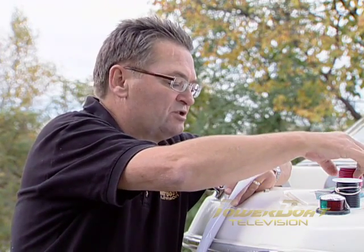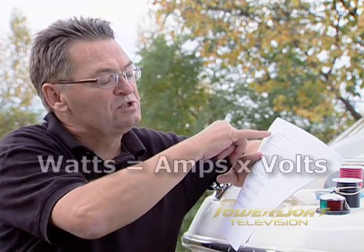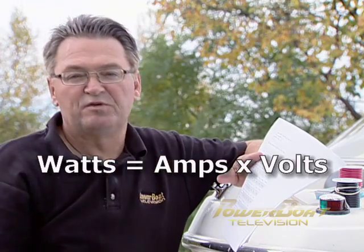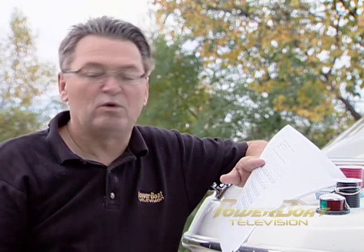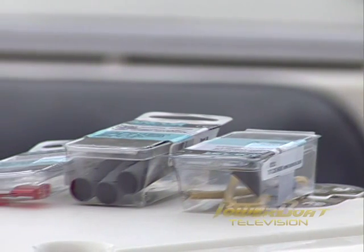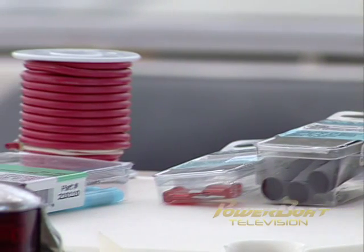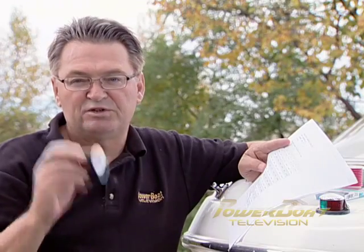The first thing you have to do before shopping for wire is to figure out what wire size — the AWG rating — you'll need. That's figured out using the formula: watts equals amps times volts. We've got two 50-watt lamps, so that works out to 4.16 amps per light, giving us a rated capacity of 8 to 10 amps. For the distance of the run, we've picked 14-gauge wire.